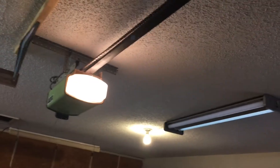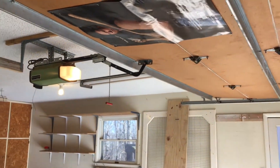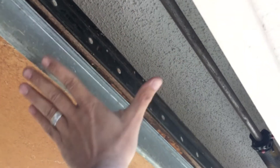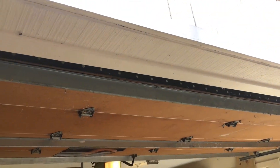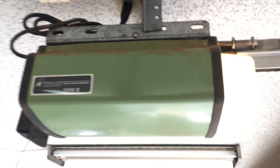I think that's the final adjustment — let's try it one more time and make sure that it actually works. Oh yeah, it stayed up! And that is flush — this is flush with the threshold, so outstanding. Now we can get the truck under here. All right folks, thanks for watching — and if you have the same type of garage door opener and you have the same issue, maybe that will help you as well.